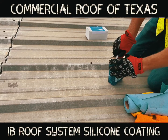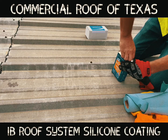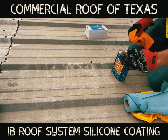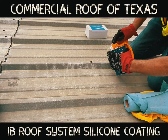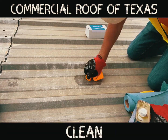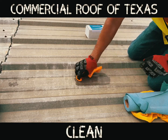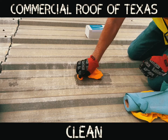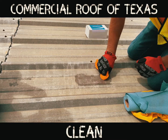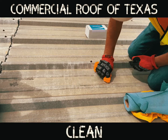All right, so we're going to use a little one — got to get it open, that's nine-tenths of the law. Take a rag with some mineral spirits on here and we want to clean any oxidation or anything that might interfere with our adhesive. Part of the process of doing a full coating is to pressure wash the roof with a cleaner prior to actually doing that, but for this test we're getting it clean and making sure it's nice and dry.